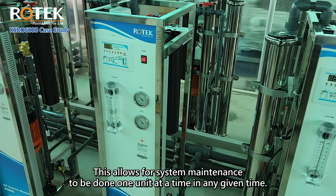Let's take a look at the main control panel that powers all 10 systems. There is a power breaker for each machine as well as a timer relay. It allows the systems to start up automatically one by one with an interval of five seconds, acting like a soft starter for traditional large RO systems. This avoids sudden voltage spikes that may cause a system failure.